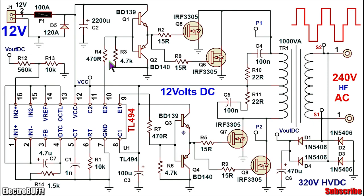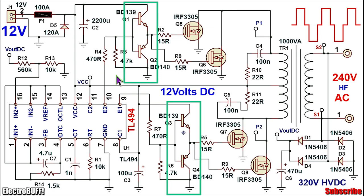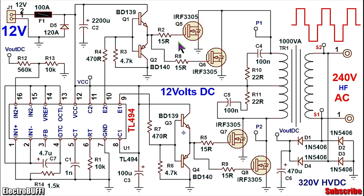I'll be using the open emitters pin 9 and 10 to control the switching MOSFETs — from each emitter connected in series with a 470Ω resistor rated for at least 1W. The IC can give a maximum output current of about 200mA. This may be sufficient for low frequency applications but at high frequency this is not ideal and can cause the MOSFETs to overheat because they do not switch properly. So I have included a current boost section made up of bipolar transistors BD-139 and BD-140 for each side. This boosts the output current from the IC to more than 1A, giving a much higher drive current to the gates of the MOSFETs at 50,000Hz.